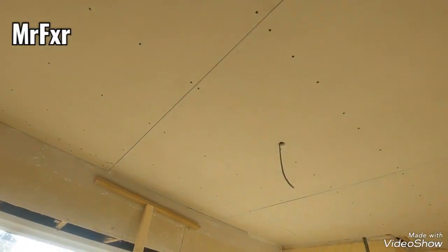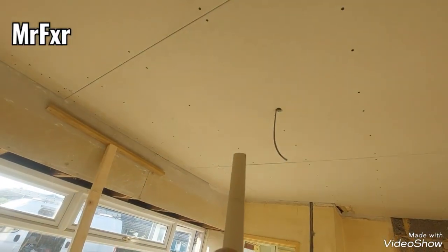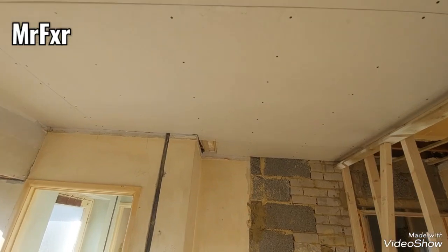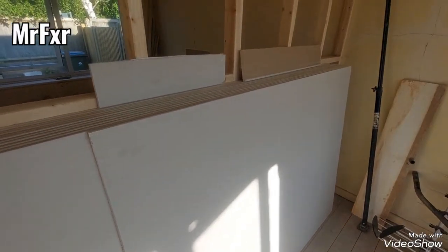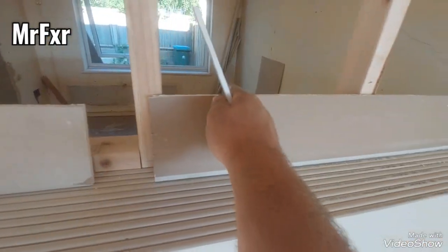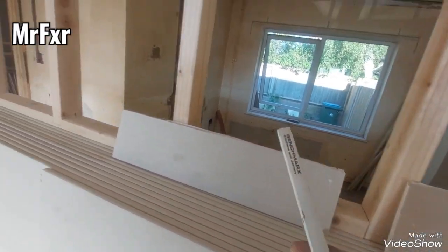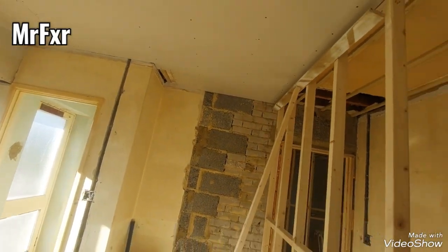So one room ceiling is done. As you can see, there's one joint on that end, then one joint on this end, and one joint on that end there. And all I need to do is just fit one small piece there, which is 5¾ by 14¾. Now all the offcuts I have, a 3/4 sheet here, I'm going to start another room with that. And I have these two small pieces. This is 4.5 inch and 5 inch. I will use that somewhere in some other room when I get a small corner like that that I need a little piece. And I will have some more little offcuts that I can use for there. So I'm not going to cut a piece for there yet. I'm going to utilize some of the wastage from other rooms.